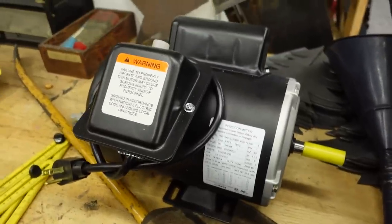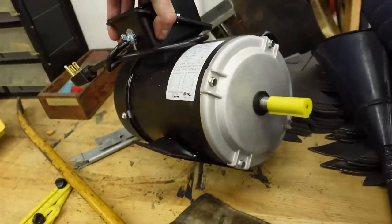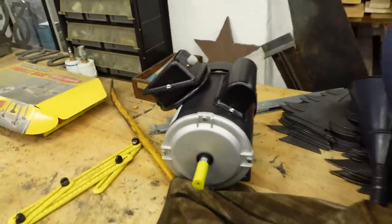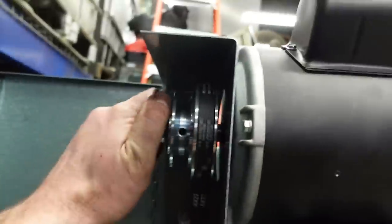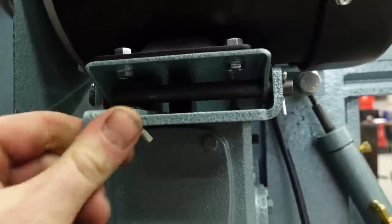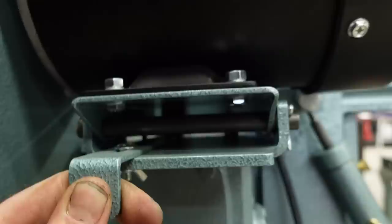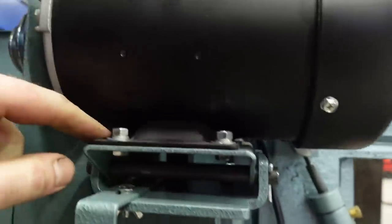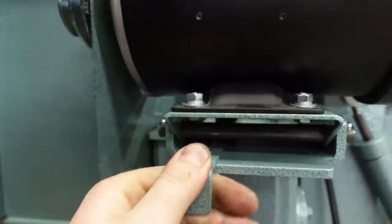I was really hoping to see that the replacement motor is of a different brand, but alas it is the exact same motor. It's got this plug because all you have to do is plug it in. So let's set about replacing it. I'm going to pull this motor off. Looks like there's two set screws here in the step pulley, a wing nut here, and I believe this is to loosen the tension on the motor. Then you've got four bolts to unbolt it. This looks flush, so I'll remember that and set the new one up just the same.